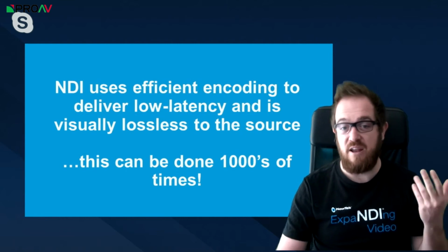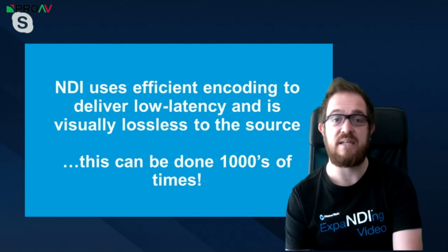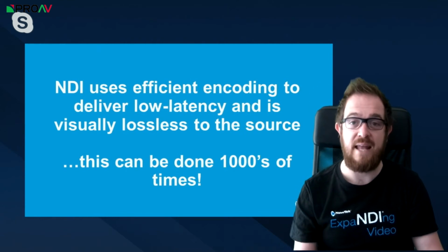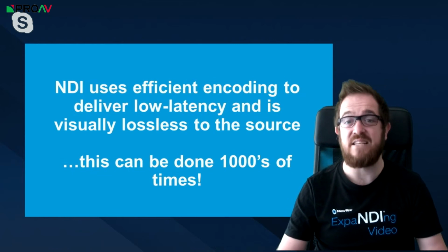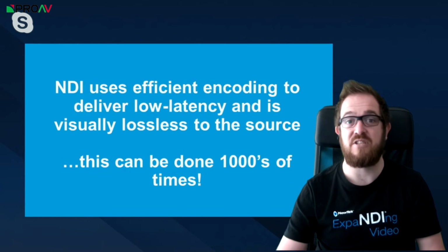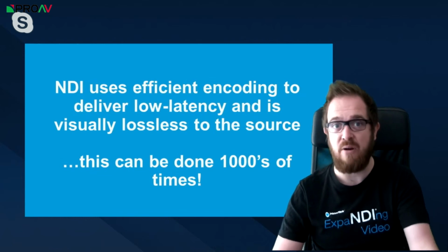NDI uses an efficient encoding protocol. It's called DCT, and I'll show you some comparisons in a little bit, which means that we can keep the bandwidth very, very low, but we can keep the actual image quality very, very high again. And because of the way we utilize it on the network, we treat everything as data all the way. It means that we can pass from device to device to device, encode and decode thousands of times before you see any degradation in the actual image quality. And we've done that in our own lab and tested that.